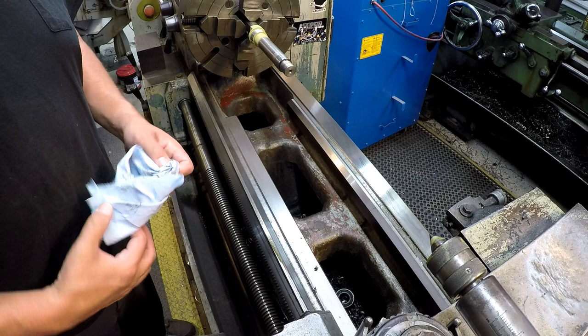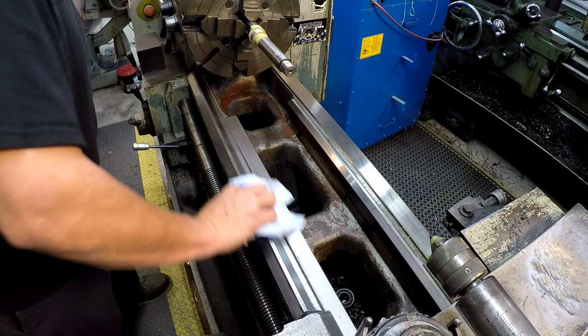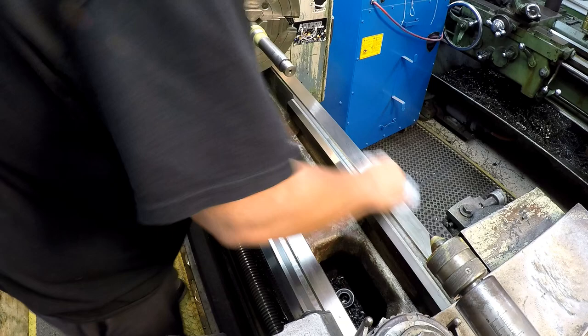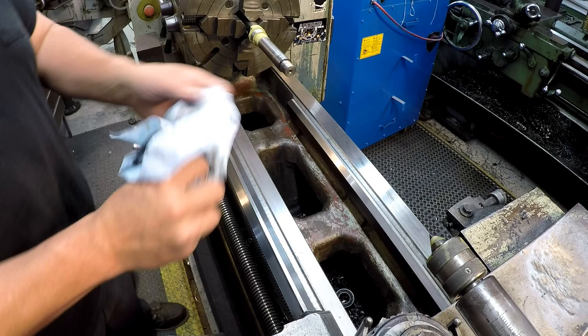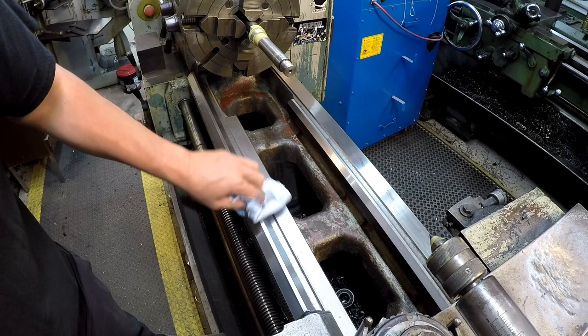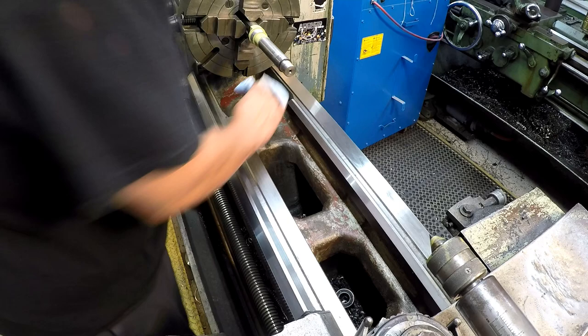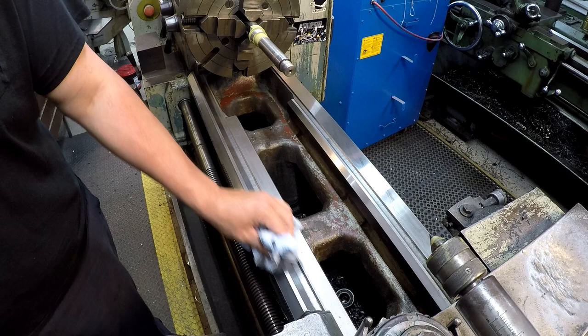I've got the way oil on the machine here, but whenever I go to spray, I just go ahead and wipe the ways off to get this oil off of it, just to keep any of the dust from sticking to them. Even the dust that's on the fire cloth itself, I've got a brand new fire cloth, so it doesn't have much on it yet, but that's something I always did, was just clean these things off and get the oil off to help keep any of that overspray of the powder from sticking onto the ways. But also remember, if you're doing this, I know a bunch of you guys out there have been collecting these metalizing rigs. Whenever you get through spraying and you're letting it cool and you're getting ready to come back and do your machining, before you move the carriage, go ahead and wipe these ways down again, just to get any kind of dust off of the ways. All right.